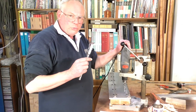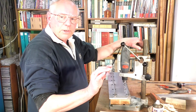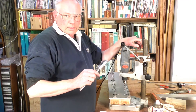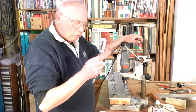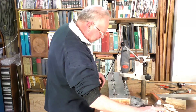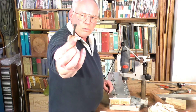If you're going to do a job like this, do yourself a favor — especially if you're the wrong side of 60 — invest in a digital vernier gauge. I think I paid something like 35 dollars for this. It does inches and millimeters — it's a godsend because I can't read the divisions of thousandths of an inch on a standard type, but it's very easy to use and tells you exactly what it is. Five millimeter, because we're going to put a six millimeter bolt in this.